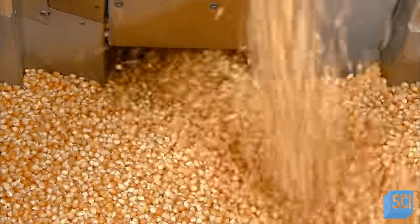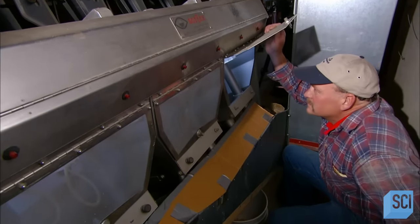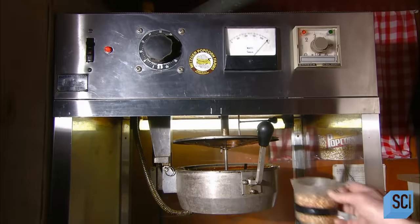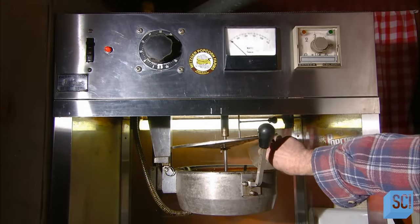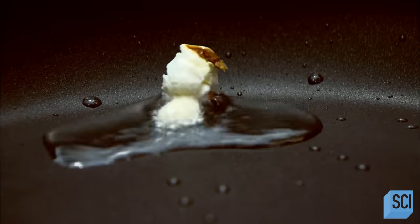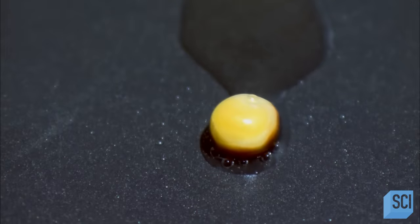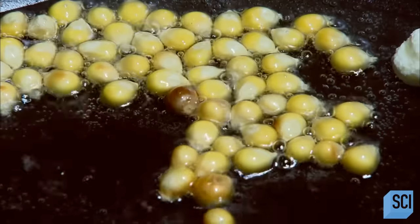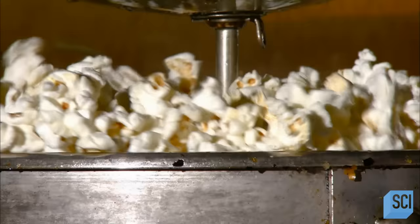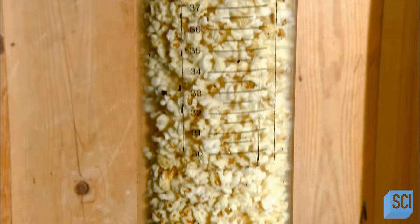The kernels now head into a very different kind of sorter. Inside, the kernels fly by an electric eye that detects remaining debris or defective grains, and the machine sends a blast of air to get rid of them. Then it's time to test a sample of the production run. A half pound of kernels is poured in along with some oil. As the pot reaches 446 degrees Fahrenheit, the water in the kernels starts to steam. As the pressure builds, those kernels explode and turn inside out, revealing the starchy part of the kernel and creating a white fluffy puff. To pass this test, the popcorn has to expand 44 and a half times the original volume.